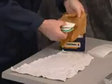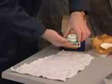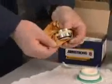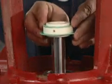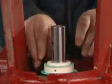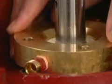Let's unpack the new seal kit. Handle the stationary seat with care, being certain not to contaminate the seal faces with dirt or even your fingerprints. The mechanical seal has a strip of packing tape around it to secure the holding clips — do not remove the tape at this time. Replace the stationary seat with the large gasket down, making sure that the seat flush hole is positioned toward the flush line connection. Now return the gland plate, aligning the seal flush hole on the stationary seat with the seal flush hole on the gland plate.